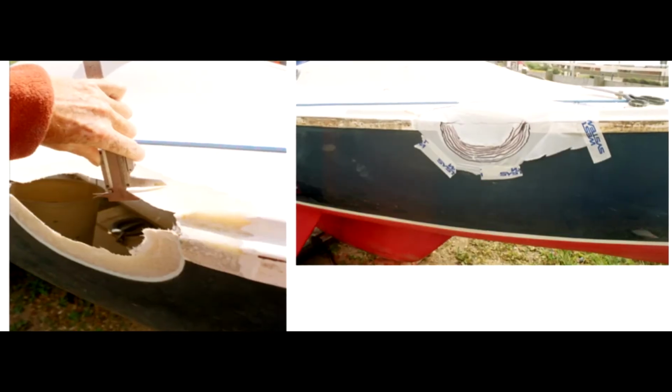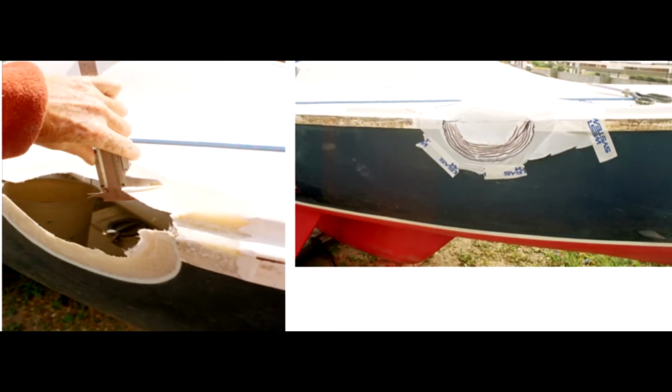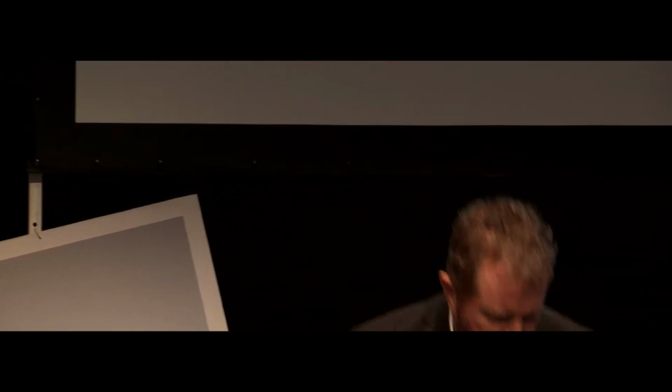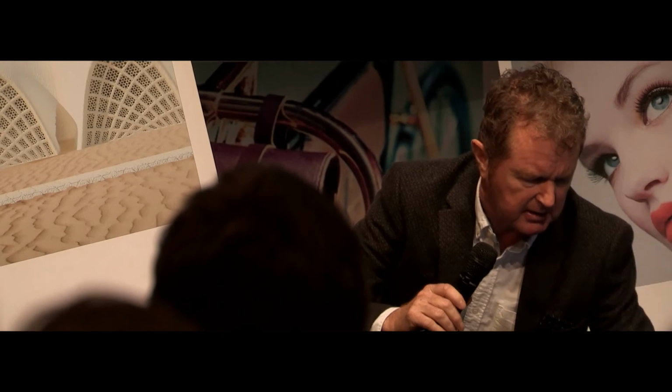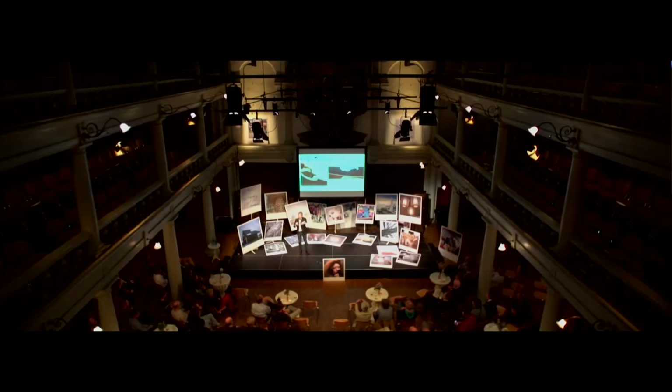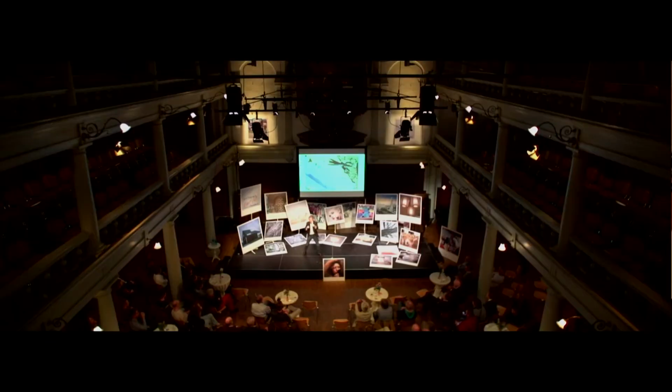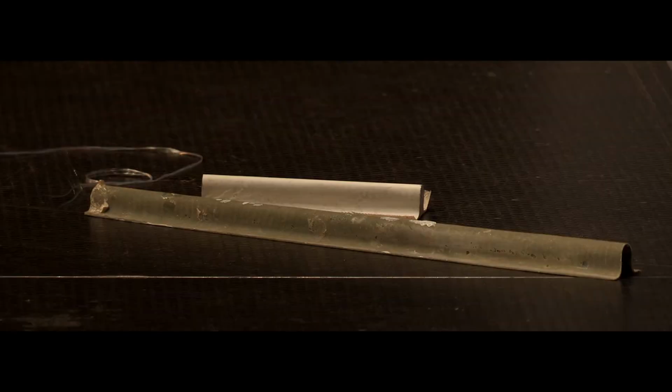Of course, these repairs can be quite involved. You can have a repair where you have subtle damage to a deck edge with a lot of detailing, maybe a moulded rubbing strake, and it's very easy to take a splash, a little mould, off the other side of the boat, that you can then make another bit of rubbing strake and glue it onto the other side. Really neat and clever things that you can do. You can only do that with the adhesive power of epoxy resin.